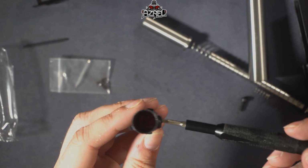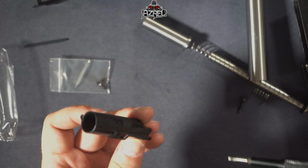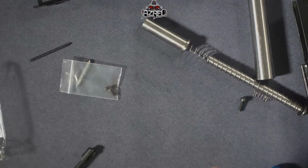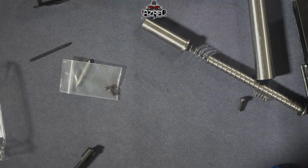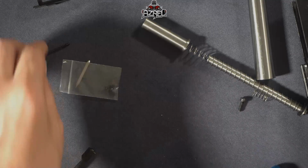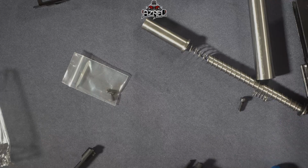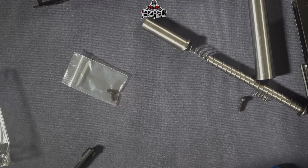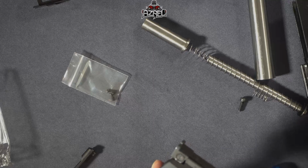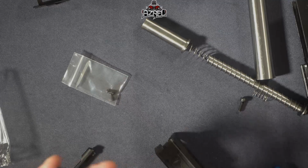You can see the nozzle, if I put my screwdriver in there, has literally completely got stuck forward. Second time that's happened with the Garda nozzle. I won't be buying those anymore. So I'm going to use the original stock nozzle that came with this gun. It's an old nozzle and I'm hoping it will last, but for the moment I'll use that, and I will replace it with something else. I'm going to have to investigate different nozzles that we can use with this frame, because I like the Garda housing. It seems to work and it's lighter than most, but this nozzle is just not playing ball.